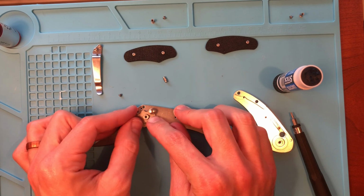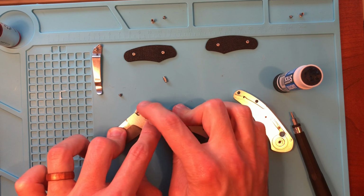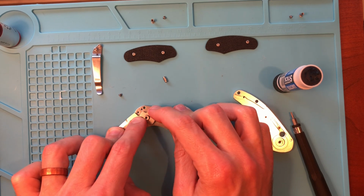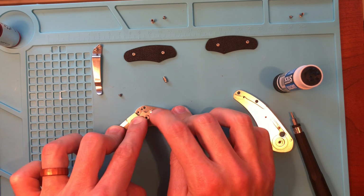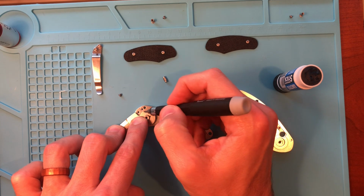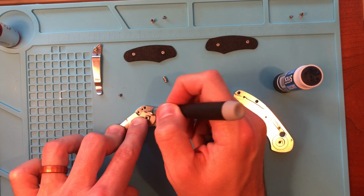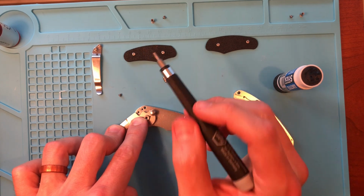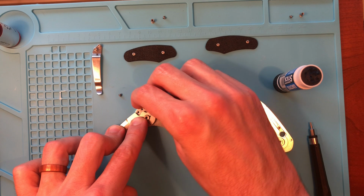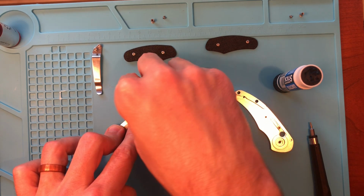All right. Hold down pressure on the blade. I turned the blade now so that this rounded portion of the blade stock will hold that pin in. If you don't, you go back to this half crescent moon shape here, that pin's going to come firing out just like it did last time, and then you're going to be back at square one trying to dance it back in there. So now, the next portion of our operation here, now we'll put the stop pin back in.